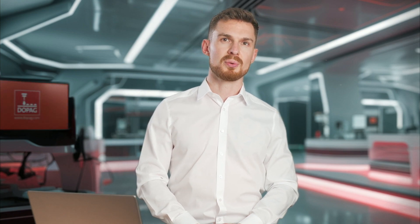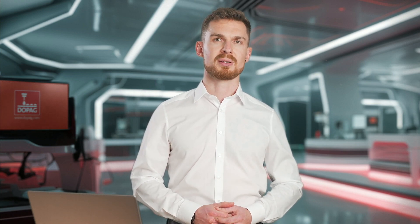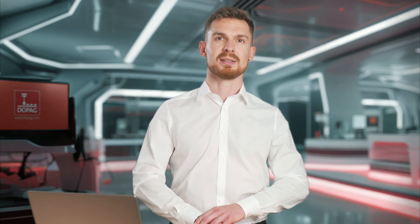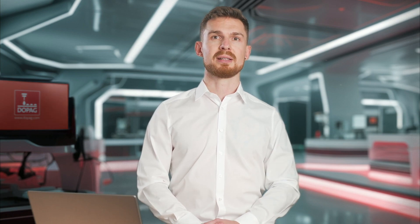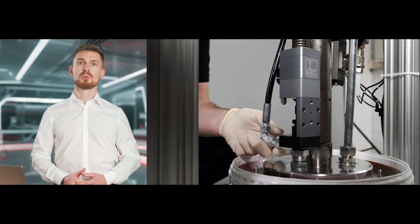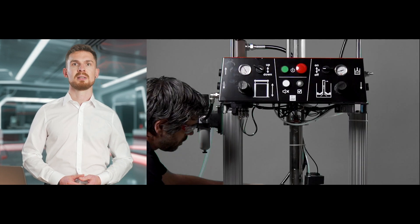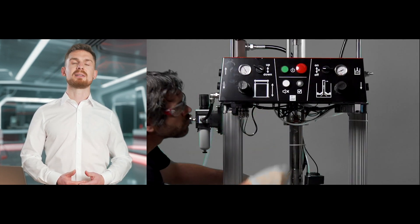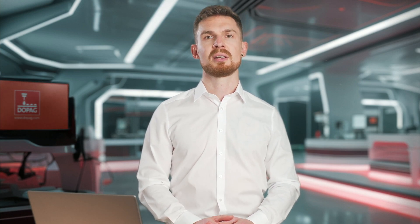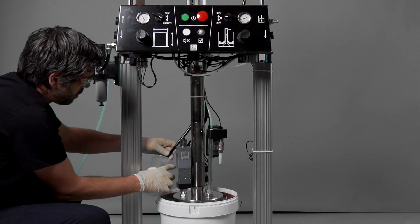Next, the pressure release unit is de-aired. The pressure release unit is another add-on option. This ensures that the pump pressure is released under the follower plate during downtime by means of material return. This counteracts any possible material separation with pressure-sensitive lubricants. The pressure release system only needs to be de-aired once during the initial commissioning. First, we detach the hose from the return module and place it into the collection container. Then we switch on the pump drive using the rotary switch. The pump begins to work. Once the air bubbles are completely expelled and the material appears uniformly from the hose, we switch the pump off using the rotary switch again. To complete the de-airing process, we reattach the hose.